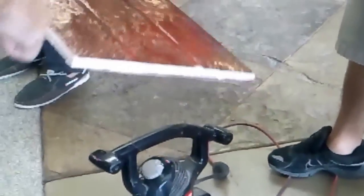It changes that look, but just even this here with hitting it with that squeegee, was making the straight with the brick, you know, the spray down knockdown, and we put this stuff over it. And look at that, texturecrete over. We put the texturecrete down first. Spraydeck is not really good for interiors because it's too textured. It's going to rip up a mop. But you do something like this, and you get an awesome look.